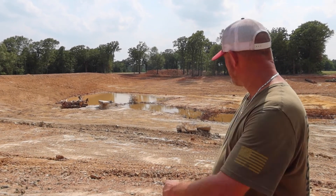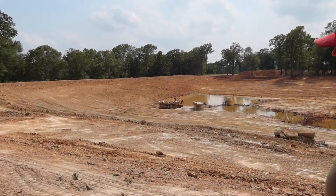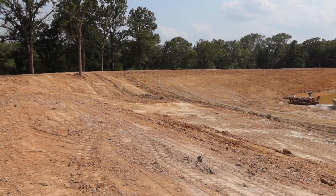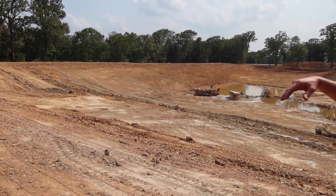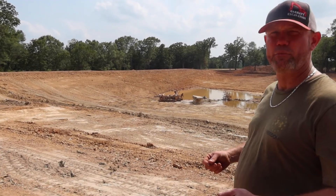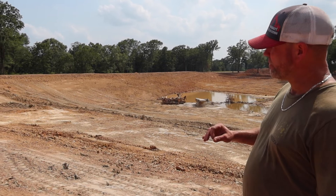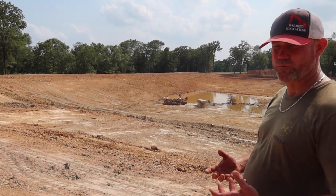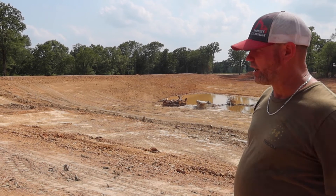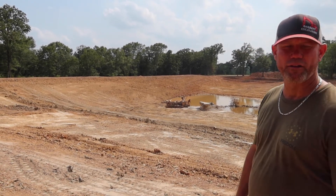As you can see, we had the spawning beds down there. We basically cut a trough at three-foot elevation down to six-foot elevation in certain areas, and we put the geotech — it's a nylon fabric that's woven together about six mils thick — and we roll that fabric out. That keeps the grass or the underwater vegetation from coming through over a period of time. Then we put the pea gravel, so those bluegill, they like to spawn on that.